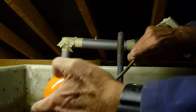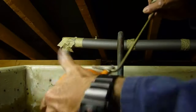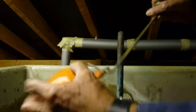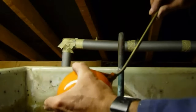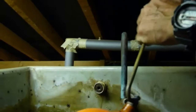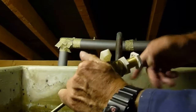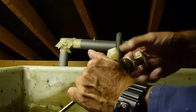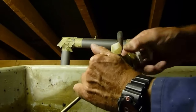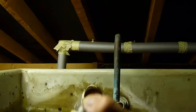There's the old ball — you don't need to get a new ball unless you've got something seriously wrong with it. If it's an old copper one, for instance, it goes in the scrap bin. It's worth more than a plastic one. So take your ball. This one's been adjusted up quite high. With your new ball valve, split it like you've just done there.